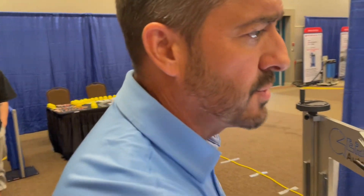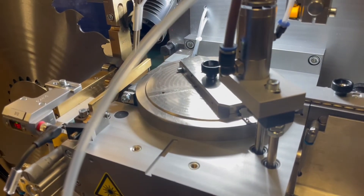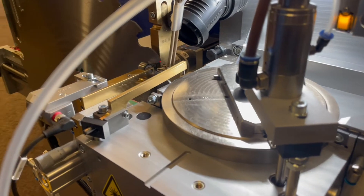Then there's an annealing cycle to anneal the horn. The brazing grip backs out. The horn, or the saw, rotates down so the horn is between the coil, and it heats up to a pre-programmed annealing temperature and annealing time. We'll go ahead and start that process — the saw will index down and anneal, then go on to the next tip.